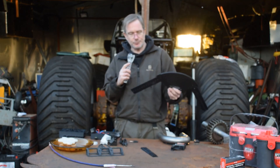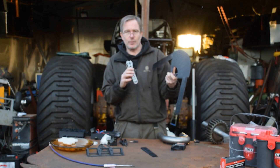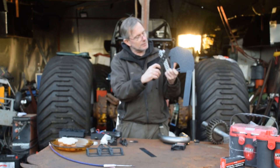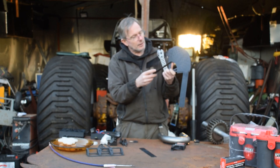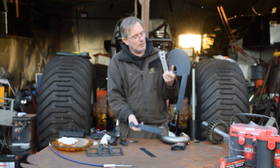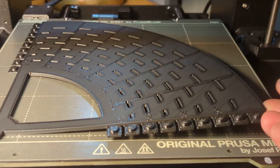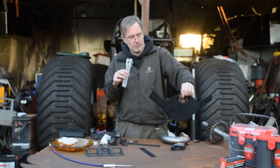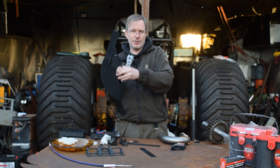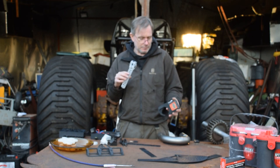I made this protractor. It has the centerline radius of 7 and 4 inches, and you just print out your tube sizes that you have. You put it in on your centerline radius and cut away the rest — you also cut away these tabs — and you measure from this border. It's between 0 and 180 degrees, so it's pretty big. It's also free. You can print out two of them and clamp them together. When you're doing the main hoop, you're actually holding the right degrees in your hands, and I'll be doing some bending for the body panel to be mounted on.